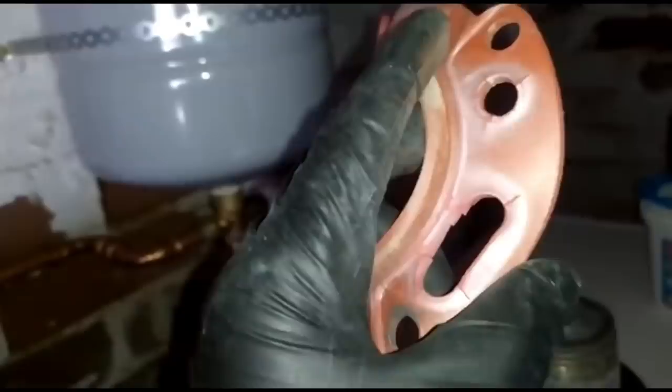So other than the fact this one's burning out, as you can see there, that's been replaced. The baffle set's been replaced. New burner seal, because the burner seal is not completely dead, but it's not great. See the cracks on it there, look. But just check that all the screws are in. This one, two screws are in at the front.